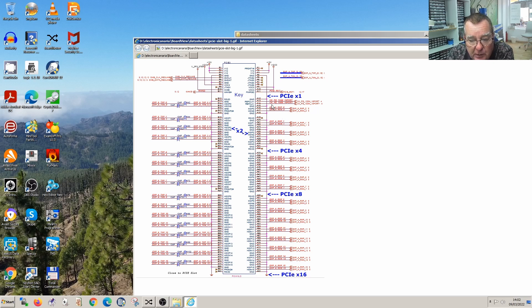There's one more differential signal: the ref clock or reference clock. This is a signal into the GPU, and this reference clock is essential for data transmission. It uses a clock to know when to expect on any one lane either a differential signal or a same signal. That's what the clock's for.